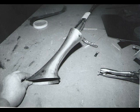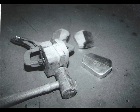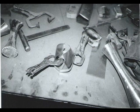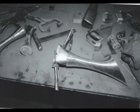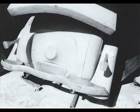They were some old stanchions from something, but anyway, there's the top and bottom put together. I've got them welded up. Now I'm hammer forming the tail light bezel. Now I'm making the transition pieces, clamping them into the bezel so I can weld them to the extension. Got them, weld them up piece by piece, putting them together. And I got them to that point.